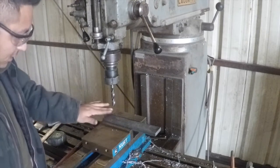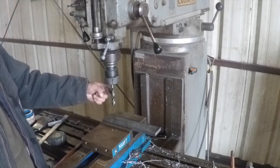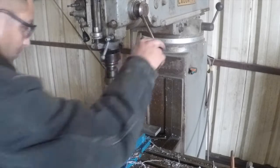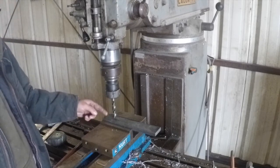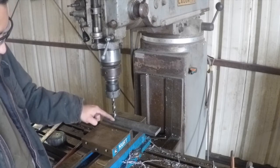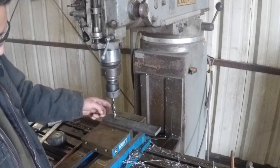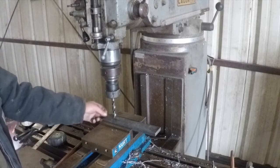I've got my two-inch flat stock flat bar already set up, and I've got what I think is a 17/32 drill bit — that's our tap drill. It's already centered from the two-inch square tubing we did, but I'm going to come in two inches on both sides. Everything's ready to go. This is a nice sharp drill bit so it shouldn't be a problem drilling through this half-inch stock.